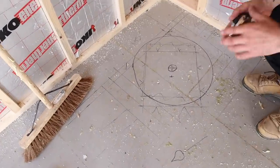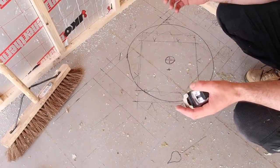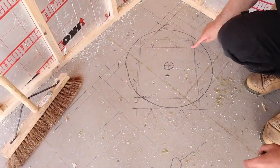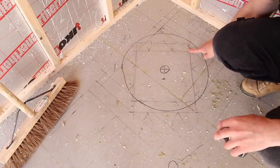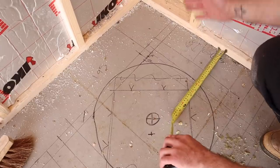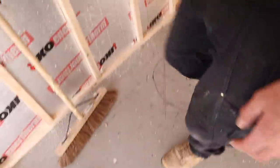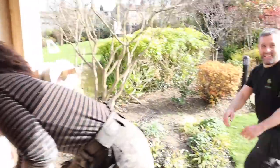It's a really tiny little stove, designed for gypsy caravans, yurts, and stuff like that. That is the size of the log burner. The center of the flue has to be 200mm off any wall, so we've got 240mm there, which will allow for our fireline plasterboard plus the backing — I think he's having slate or a sandstone backing. So that's going to sit there and flue out of there.